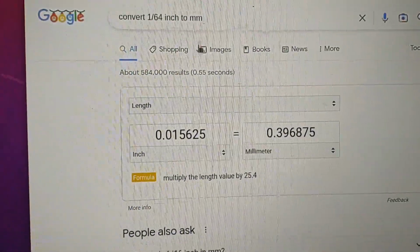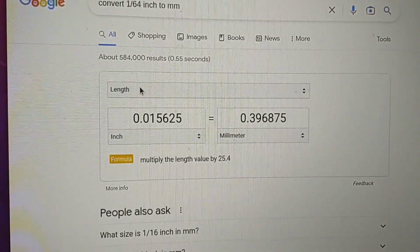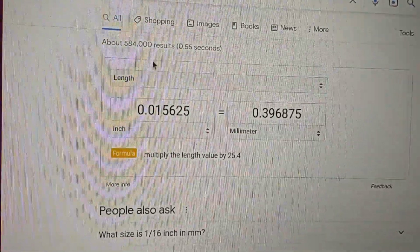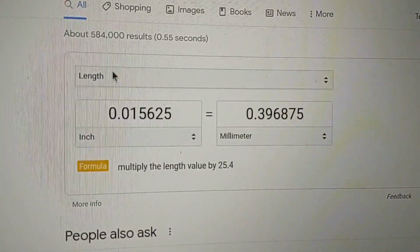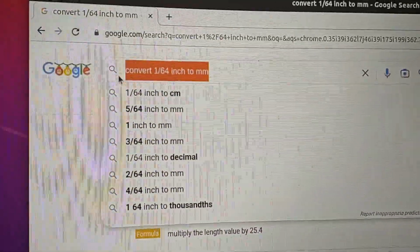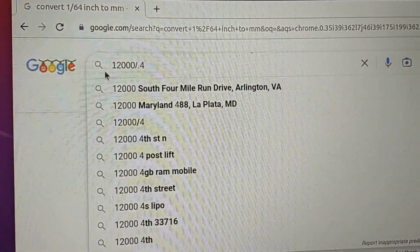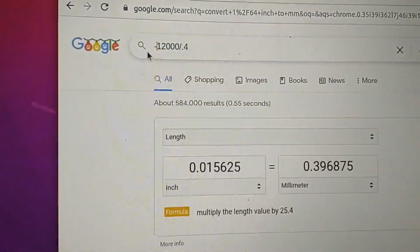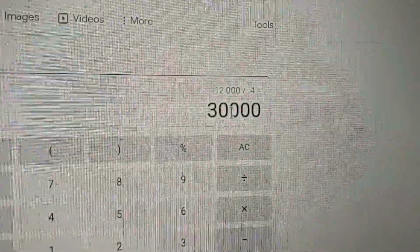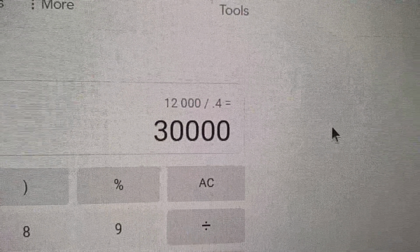That is about where our arc breakdown started happening underwater, because remember the screw is 32 threads per inch, and we're about half a turn. It's about the limit of where it would hold off the voltage. So we had about 12,000 volts divided by 0.4 millimeters. That's volts per millimeter, and I want to convert that to megavolts. So that's about 30 megavolts per meter, if I'm doing the math right.